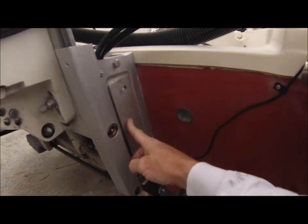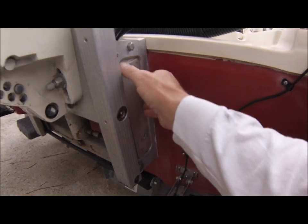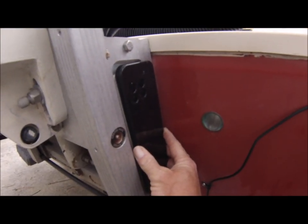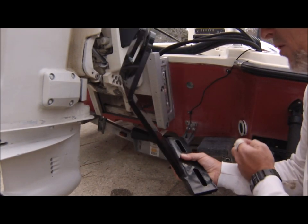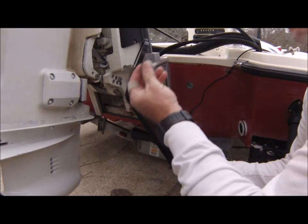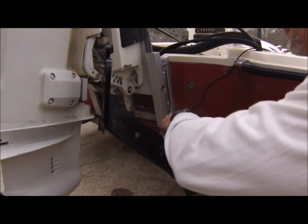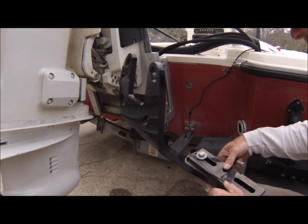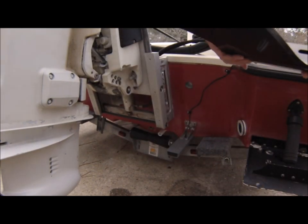I've lined my holes up with this spacer. This little spacer is just about an eighth of an inch thick, which is about the same thickness as the little cutout — which ended up being perfect. Now I'm going to put this spacer on top of this other little piece of metal and mount my bracket. I'm going to mount this power pole bracket to my jack plate. I'll put the bolt with the washer through the plate and through the spacer, put the other bolt the same way through the bracket and through the spacer, and then put it through the jack plate.